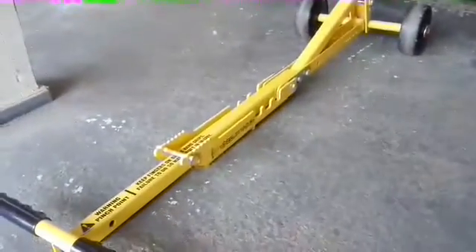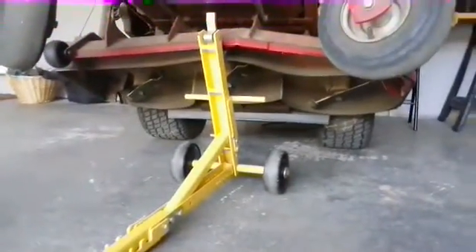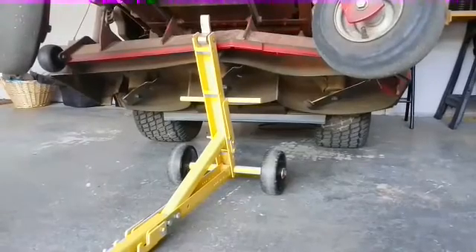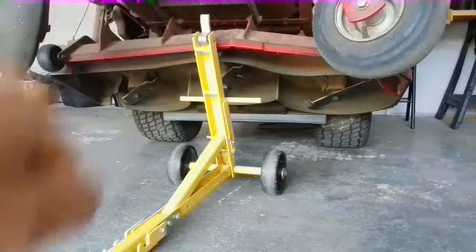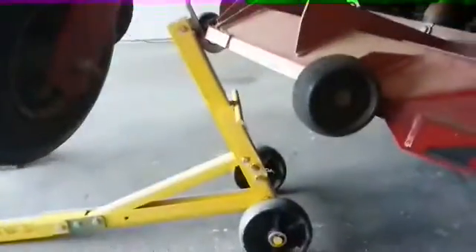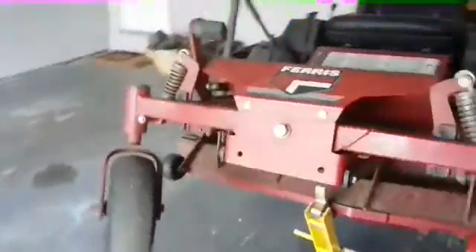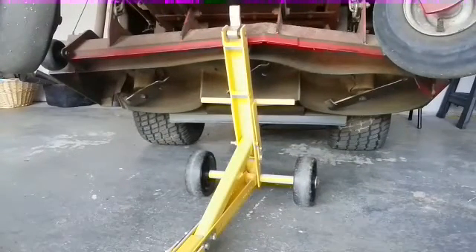Oh, and another thing — this jack right here, it's called the Jungle Jims Jungle Jack. These are amazing for zero-turns. Walk-behinds are pretty easy to jack up, but I like this because when it's down you just put it under there, pull down, and pop it up. It has the correct angle — more laid back than an L — so once it's down it wants to hold itself under the mower and will not fall. Great design. I think you can buy them on eBay around 200 bucks. It's made my life so much better.